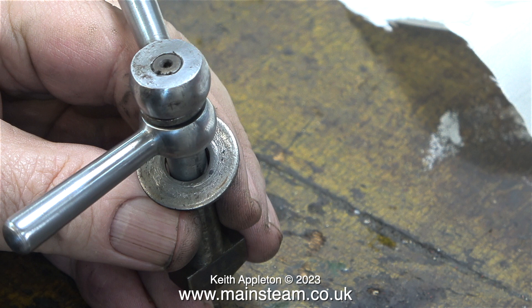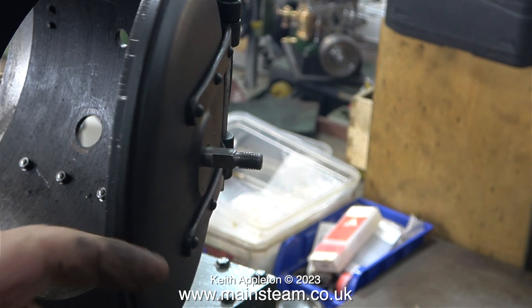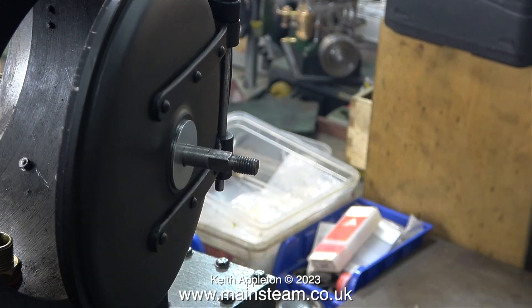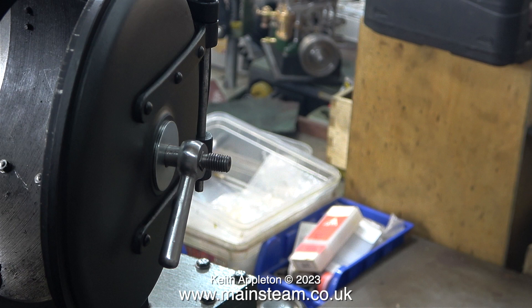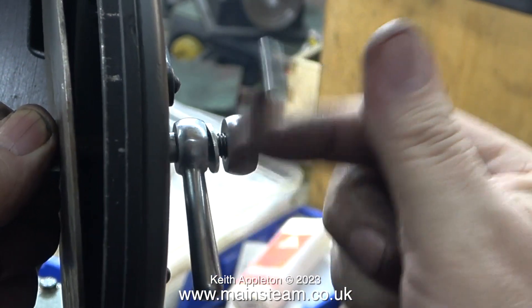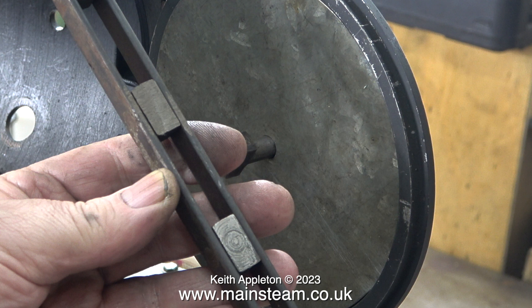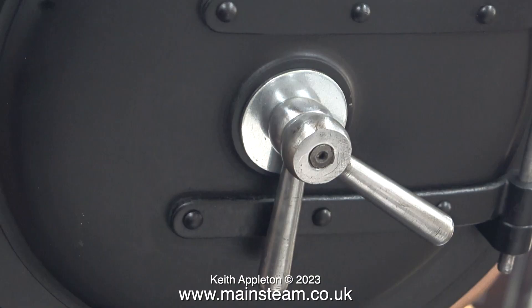This is the locking assembly for the smoke box door. A steam locomotive's smoke box needs to be completely airtight. The metal plate visible behind the smoke box door is nothing to do with the air tightness — it's just a heat shield and not really necessary. I drilled out a couple of new washers because the old ones were quite badly marked. The shaft is squared, so if you rotate the lever the part inside will move. The outer lever is just a lock to keep everything in place. There is a crossbar inside the smoke box, held loosely in place on two supports. As you close the smoke box door, you engage the locking mechanism with the crossbar, then turn the inner lever through 90 degrees and lock it in place with the outer one — simple and very effective.